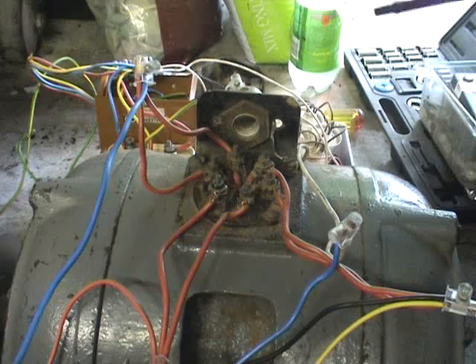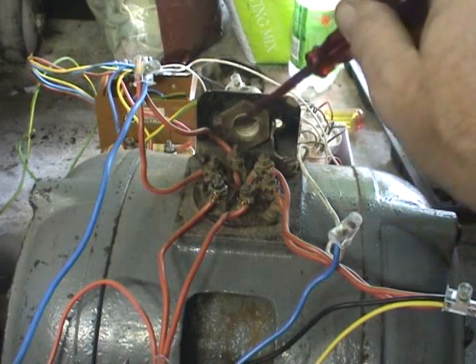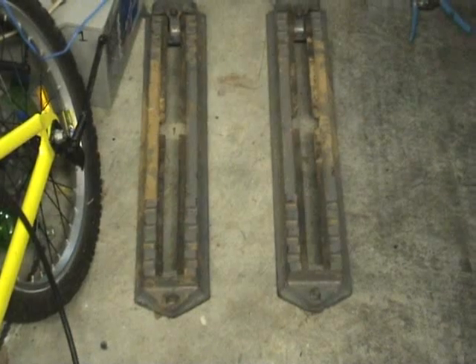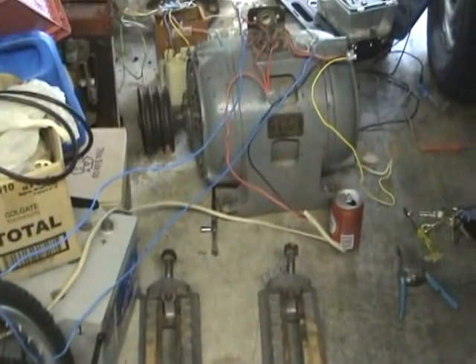The terminals are A2, B1, B2, C1, C2, and A1. I've connected them in Delta at the moment. It has six terminals with a star-delta option, but I've got it in Delta. I got the motor complete with an adjustable pedestal mount.